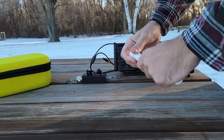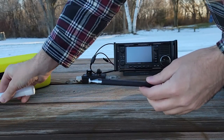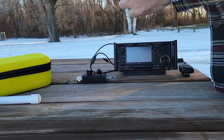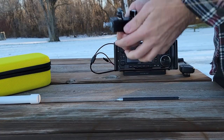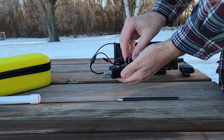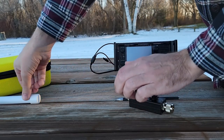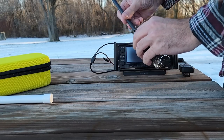I'm always looking for solutions for antennas, and I found this one on eBay. It's kind of interesting — it comes with a little PVC tube to protect the whip, and it's also covered in heat shrink tubing for some reason. It is a five-ish foot whip, and it comes with a little tuning unit, which is pretty interesting. It is an inductor on top — a toroid wrapped with some magnet wire — and on the bottom is a variable capacitor. On the top there's a little stud you can take off, and the only reason I can see for the tube is so when I take the stud off, I can drop it in the tube so I won't lose it.